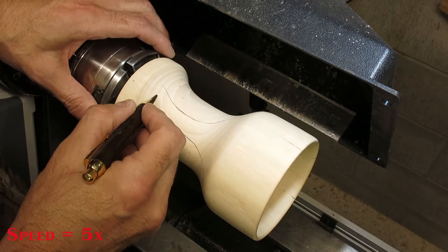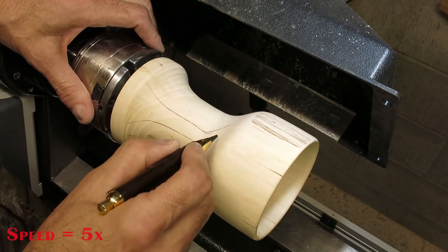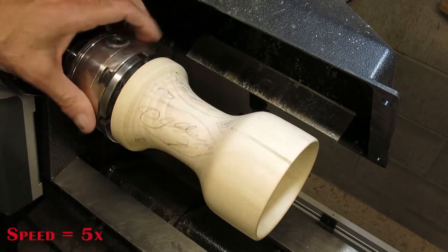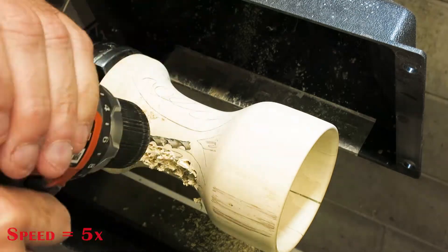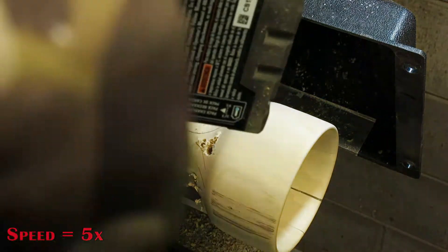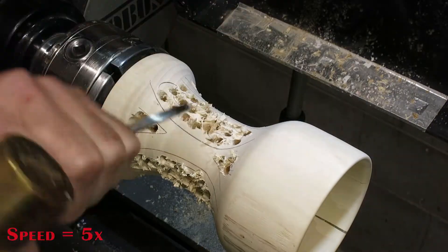The project has been sanded to 320 grit and now I'm drawing on the area to be carved — basically the three trunks that I'll be carving out. I start the carving process with a small drill, just trying to remove the bulk of the material. I'm not drilling all the way through, just trying to get it started so I can get at it with my other tools. The main thing is not to drill too close to the bottom of the bowl, which is finished. The last thing you want to do is go through the bowl.